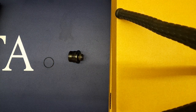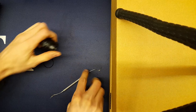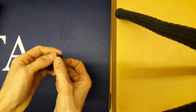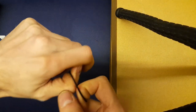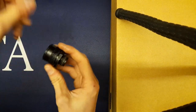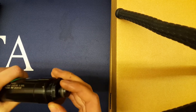Now we'll replace the outer o-ring that was probably causing the leak on this side. Use a small pick to remove this body o-ring. You can see this one is very square — it hasn't been replaced by whoever had it in. It's lost a lot of its flexibility and snapped quite easily. Put the new one on with a little bit of Molykote grease, pop it around, making sure there's no crud in the threads, and pop it back on. That's it done — the round is back on, all sorted.